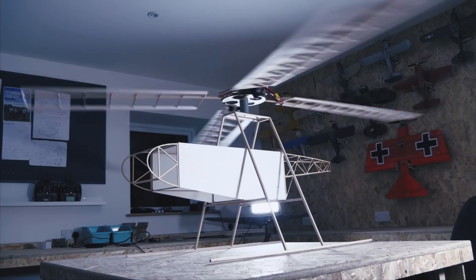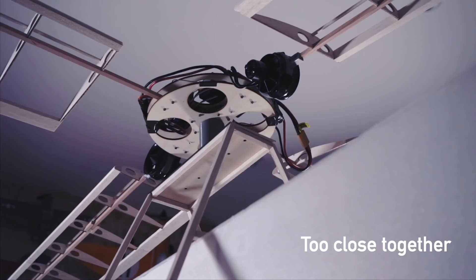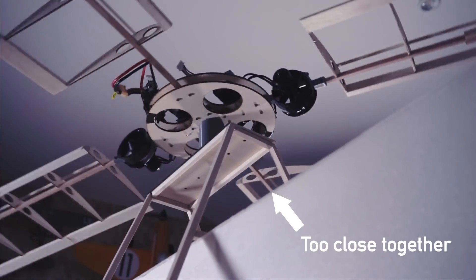I think one thing that's immediately apparent from that last test is that the rotary wings aren't spinning fast enough, or at least not as fast as they should be, which was one of my main criteria. So before the next video I'm going to reposition the motors by spacing them out a bit more, to get that moment of torque that's ideal for achieving optimal speed on the tips of the rotors and therefore creating enough lift. I'm going to put them on that 45 degree arm that I mentioned back in the build section of the video.